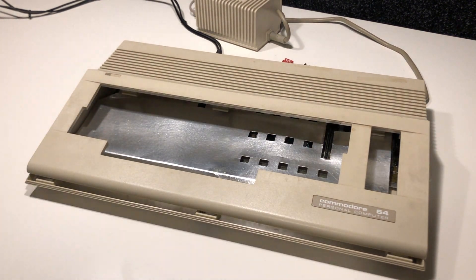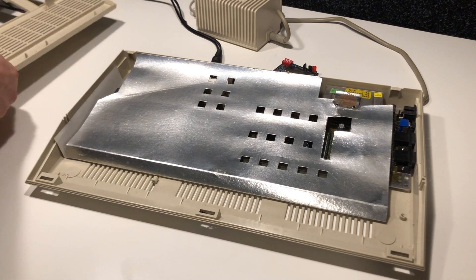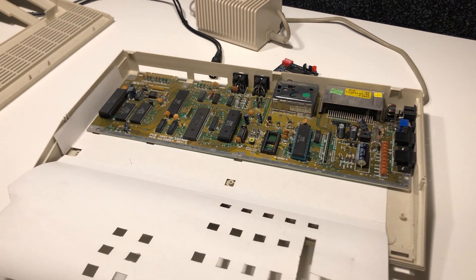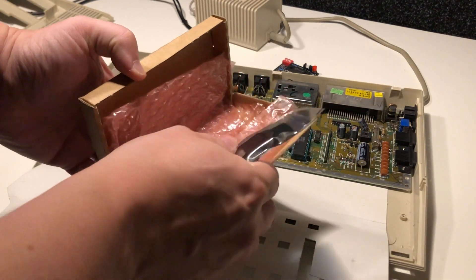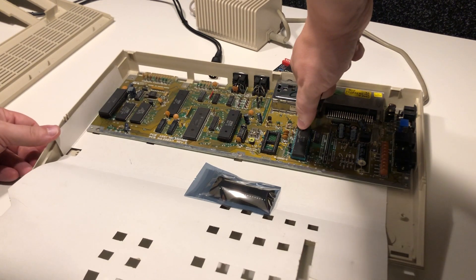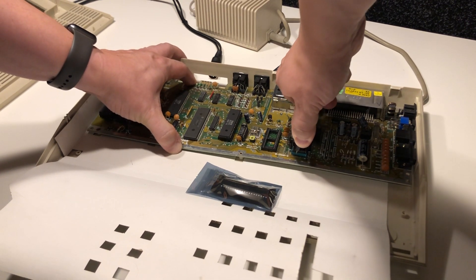Now I have another tool to continue working on the pile of Commodore 64s. This is Exhibit C — when we previously looked at it I had just swapped the CIA chips from one side to the other to troubleshoot, and we could see that one was obviously broken. In the mail the other day I got a new old stock 6526A CIA chip, so I'll replace it and get back to you in the next episode with a full repair. Please subscribe and check out my Patreon below.